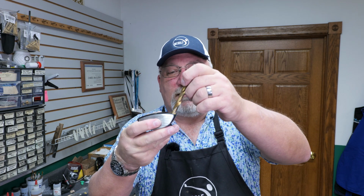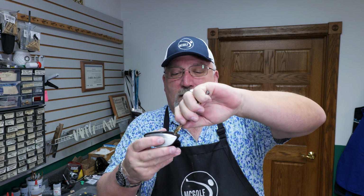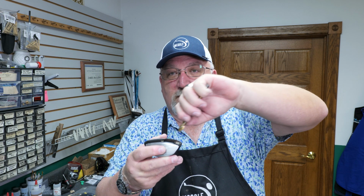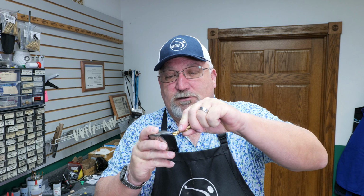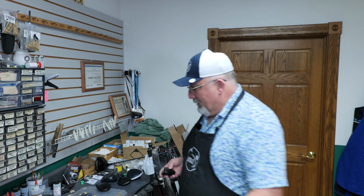Now, as a pro tip, when you get in here and you're drilling really fast, there's not a whole lot to work with. If you look at the depth of this thing, it's only about that deep. You come pulling up out of here and you hit and you go back down in there and you miss, you've just marred the whole paint. So when you work in something like this, you want to make sure that you're forcing yourself into the bottom and staying there, right? If you go in and out, only go a little bit, because if you pull out and you mess up, your natural reaction is going to be wanting to get back in there, and you have a real opportunity of marring this, okay? And that's not what we want. So give me a few more minutes here and we'll clean this bad boy up.